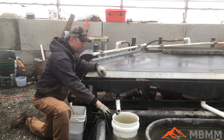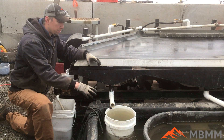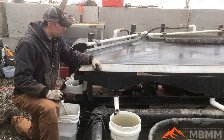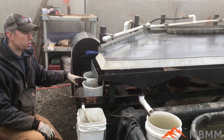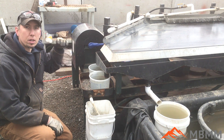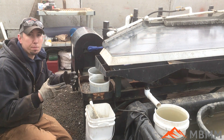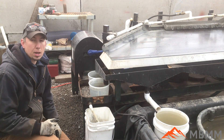Here's our number three bucket, and I'm not quite sure how much copper is going to come down to number three, so we're going to treat this as kind of a middling fraction, and if we have to, we can rerun it through the system to help get the copper over and separate the paper and plastic from it. Here's the number one and number two — we're going to capture hopefully clean copper in these two ports. There is a little bit of contamination from our residual boards in the mill and in the system, so we may get a little bit of residual fiberglass and board material in number one and number two. So if we can look past that and look at the wire, hopefully we get the wire clean of all the plastic and paper from our sample of motors we ran.